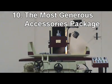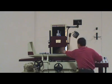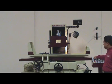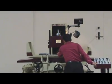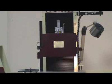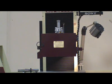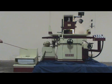Reason 10: Acer offers the best accessories package and full one-year warranty. The package includes: 1) Electromagnetic chuck and chuck control, which allows you to adjust hold power and auto-release parts easily. 2) Parallel dresser for convenient wheel dressing. 3) Halogen light included. 4) Balancing stand and arbor standard. 5) Coolant with paper filter for cleaning coolant to achieve a nice grinding finish.